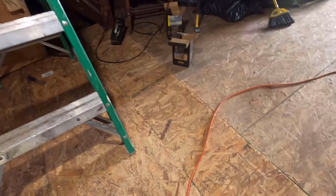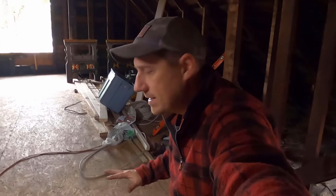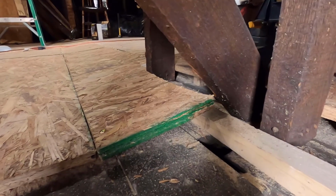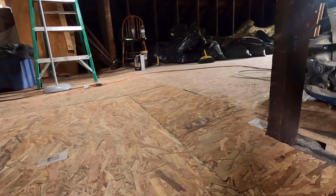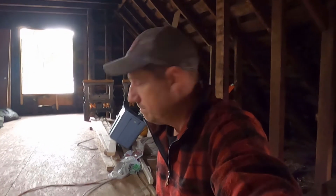So now on this transition area, I ended up with about 3/4 inches of difference approximately. And I just decided to go ahead and slope the entire strip through here. I'm going to be putting a wall here and there's gonna be 2 doorways here. So I don't think it's gonna be a big issue. And it's a pretty minor slope difference. That being said, we'll do the best we can with those indifferent floors and move on forward.